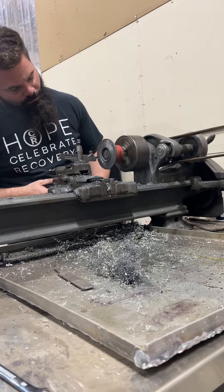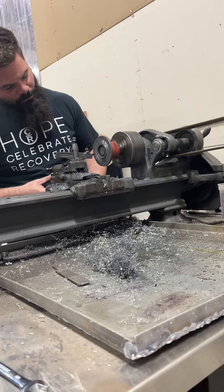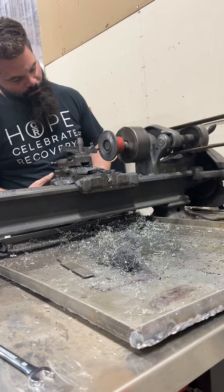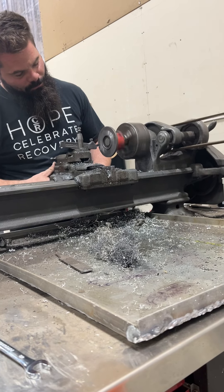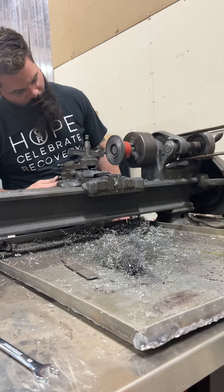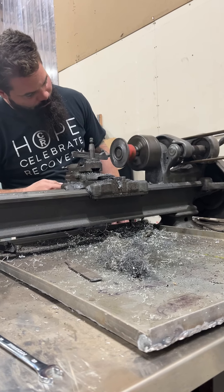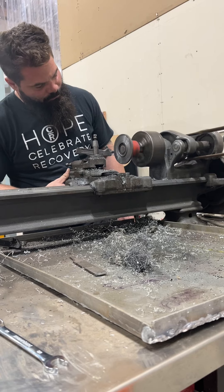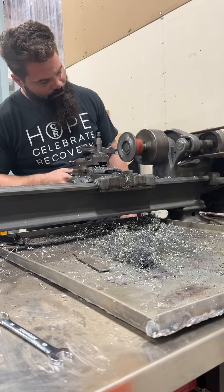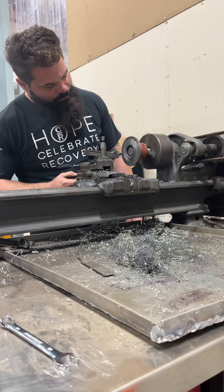It had been beat on. We're trying to get the accuracy of the alignment of the coupling halves — there's a coupling half on the transmission and there's this coupling half on the prop shaft. We're trying to get the alignment within two thousandths of an inch. Anything greater than that, this shaft will break like a paper clip in a bad meeting.